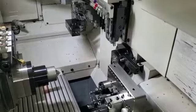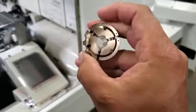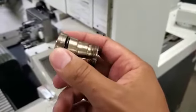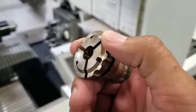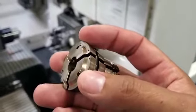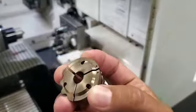The whole point to this system is that it flexes to the stock — you can see I can move it around. This is supposed to have up to 12 thousandths worth of flex. The main point is to not have to get ground material. Running cold finished material in a standard guide bushing, if the stock size varies at all you're always adjusting the guide bushing nut. This assembly is controlled by air, which controls the pressure on this collet and allows it to flex back and forth.